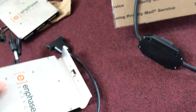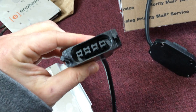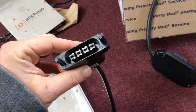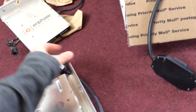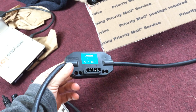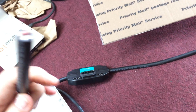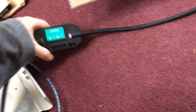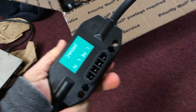The output on these things uses a special dedicated connector that has to match up with a special cable also sold by Enphase. I went ahead and bought a section of it for testing and experimenting. It's a 12 gauge cable with hot, hot, neutral, and ground, and then it has that matching dedicated connector.